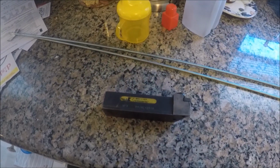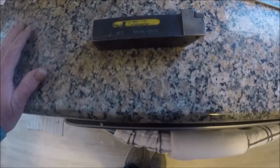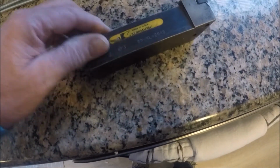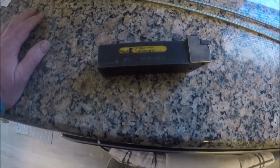Which, you say, well, I can buy that. Yes, you can. I gave $35 for it. I've got DNMG inserts. It'll take me about an hour or so to dovetail it to fit my tool block, and I'll be in good shape. I'll have another real good left-hand operation.